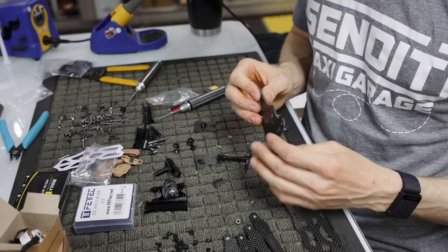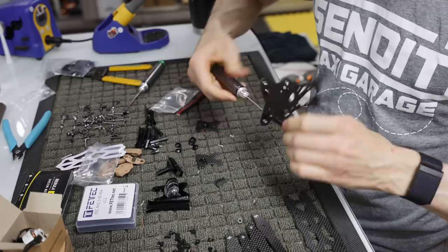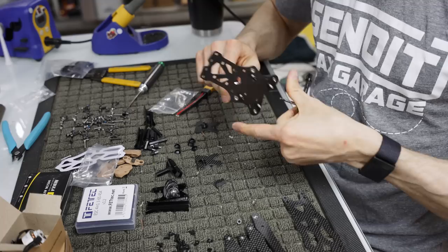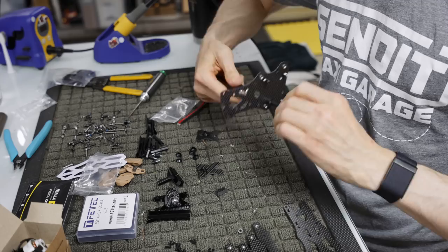We're gonna take our 2.5, or sorry, our 2 mil guy right here, and then I have a T-nut driver, or actually a 5.5 mil here. We're gonna flop this around, get this. And you remember, everything aluminum, you don't wanna go crazy tight. I don't know how often I've seen people say, oh, these aluminum screws are made of cheese, and sometimes there are cheesy aluminum screws, but in the ImpulseRC world, we use ones from Fastener Express, actually built here in California, and they are really good quality aluminum, and they should not feel like cheese.